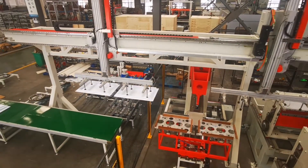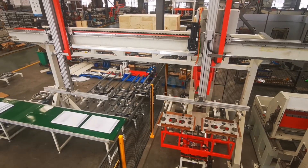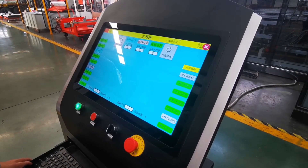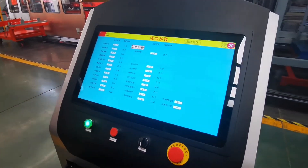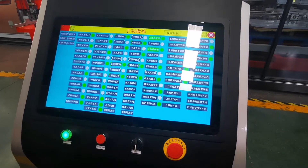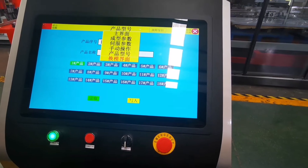Sheet movement by clamping device mainly includes gripper opening and closing by DIR mechanism, together with guiding rail system, transmitting device, width adjusting motors, and more. Sheet transmitting precision is controlled by servo motor system, which has high accuracy. Each time the sheet moves ahead by a single stroke, keeping and ensuring accuracy of movement between previous station to next processing.